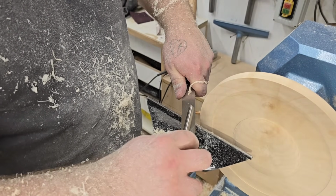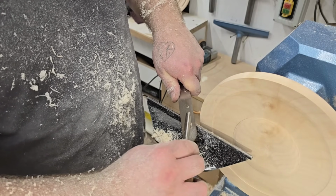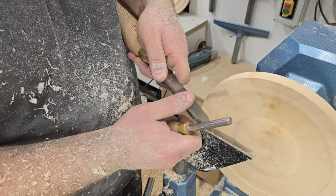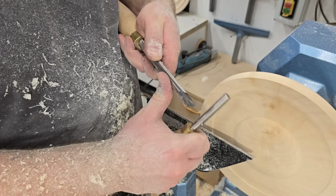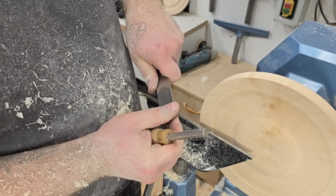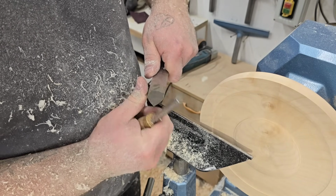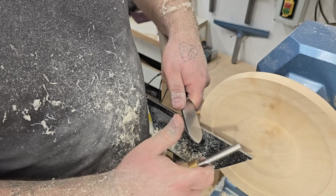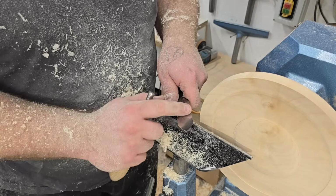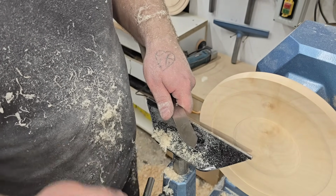Spear point, keeping it nice and flat to extend steel slightly. Find the bevel, raise it a few degrees. And you should feel a nice burr. You don't want to fiddle with that too much, going, I don't know, ten times around, because you will introduce quite a big burr or damaged edge. It won't work as properly.